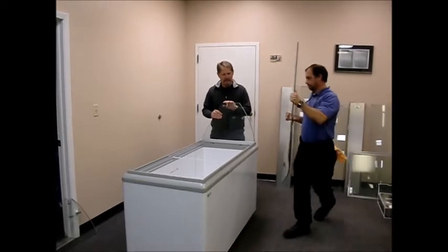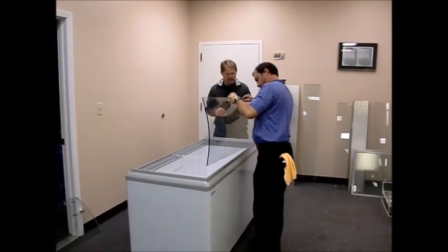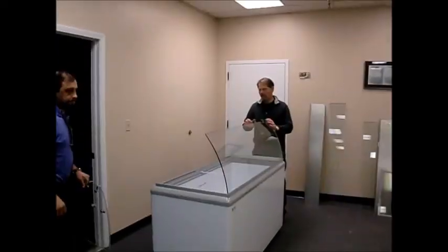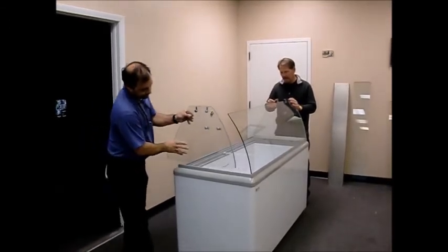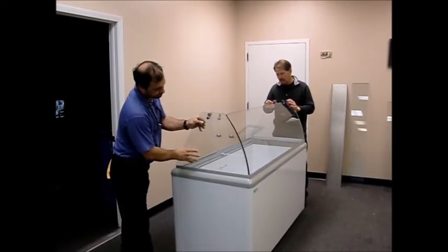The glass should be moved forward, but still leave enough room for the front glass to slide into the front track. The second person then lifts the front glass and sets it into the front channel. This is a heavier piece of glass and may require 2 people to lift. The second end glass should then be lifted into place. One person should remain holding the assembly firm.